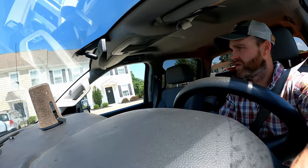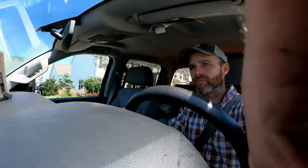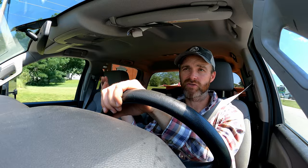All the vibratory compaction equipment is based off of its centrifugal pounds of compaction force. The Wacker Packers have about 3,300. ICPI standards are about 4,000, but everybody's used the Wackers forever. Our Bartell 1570 reversible, we love that little thing. It is at about, I think, 3,500. And then we have that great big Mikasa, and it's 12,000 pounds centrifugal force. It's good for up to a foot of dense graded fill, although generally all we'll do with that is about 8 inches maybe.